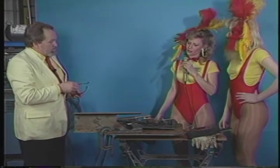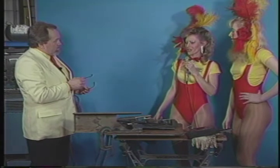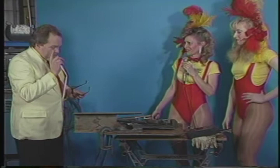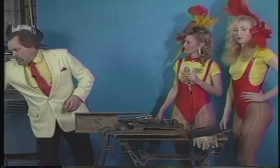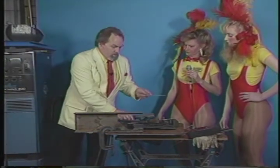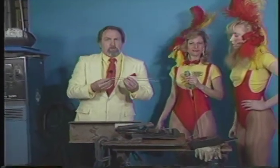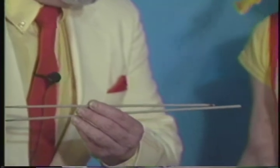Well, so far from what we've learned between the oxyacetylene and the stick welding, stick sure does seem a lot easier to do because you don't have to add rod. The rod's already there. Okay, excellent point. I'm glad you made that point. Yes, the audience should know that as I was doing that little bit of welding, notice now that the electrode is shorter, and Chuck, can we show that to our audience? The electrode, even on this end, is now shorter because the material that went into the filler rod that went into here is now down there. So we've used up part of the electrode.